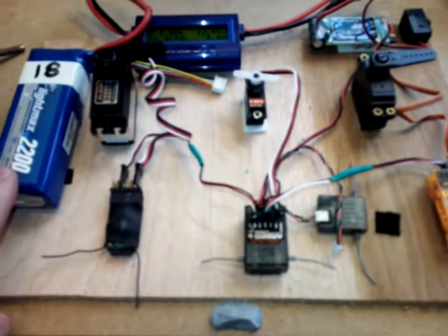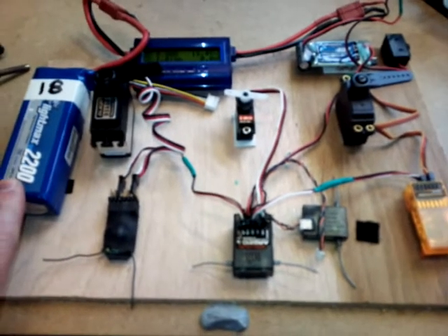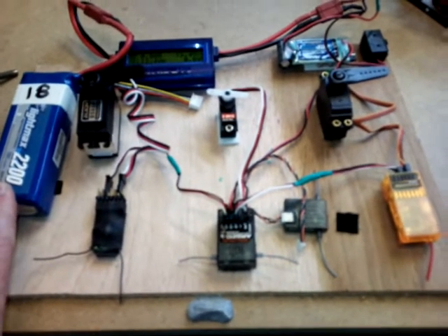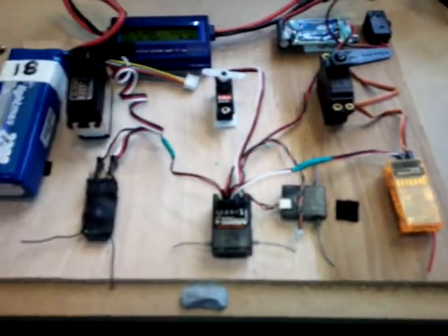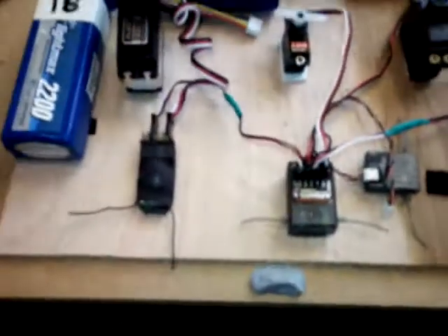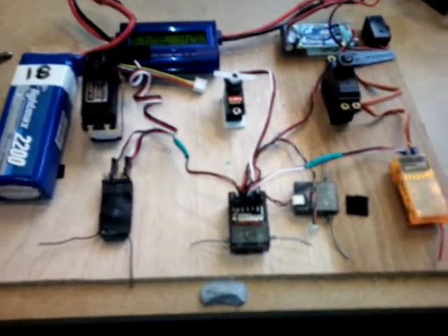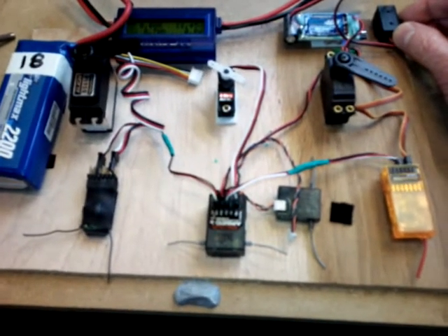On this test I've got a better battery. It's still possible to brown out this circuit with these three receivers and these two big servos because I am only using a 5A BEC, but we'll just drive it quite slowly. So if I switch this on, we should get a connection.